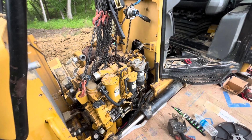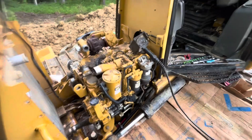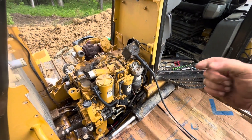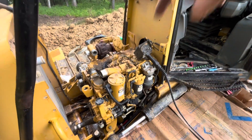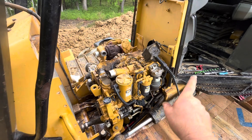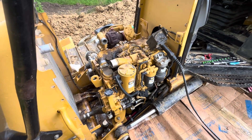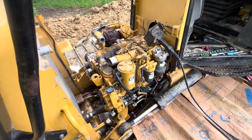So now we're going to set the engine back in the hole. I almost got it back in the hole, but there's a good chance we're about to get rained on. It rained just long enough to get everything good and muddy and nasty again — about right. The engine's back in the hole. I had to use two really long bolts, kind of stick through the pump plate and thread into the bell housing to get it in line, and actually had a crane hanging and used a come-along to put a little tension on it backwards and just spun the engine over until it lined up with the coupler and it slid right into place. Well, it didn't go that easy, but it sounds easy.